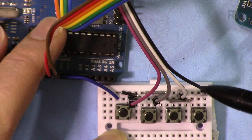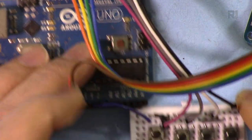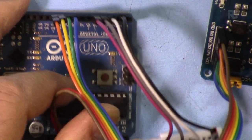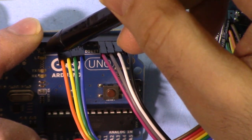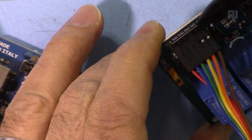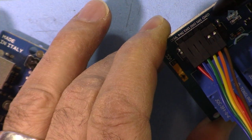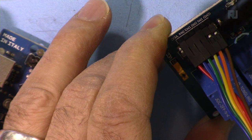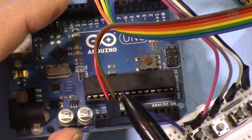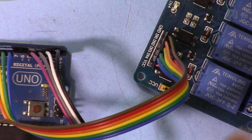Those right-side wires are connected to Arduino pins 2, 3, 4, and 5 for the push buttons, and pins 8, 9, 10, and 11 for the relay. The orange wires connect to relay inputs 1 through 4. For power, red is VCC and black is ground — VCC 5V is connected to the Arduino's 5V pin, and ground to ground, since this relay module runs on 5V.